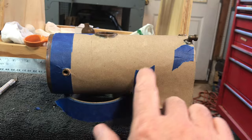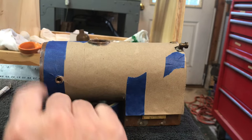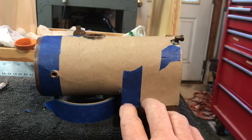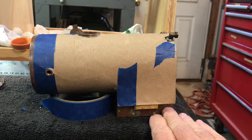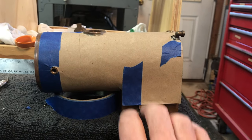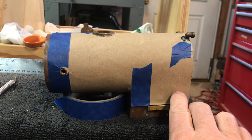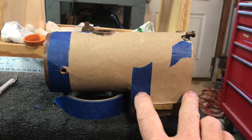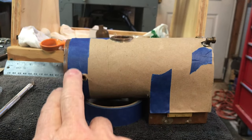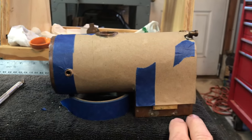I've made this paper template and reinforced it in a couple of areas. I cut it back to accommodate the smoke box, which overlaps at a quarter of an inch. The chassis line is just under here, and those little clips will come up here. I'm hoping I can make this all out of one piece of sheet metal and roll basically everything in a cylinder, except leave these two little one-inch-long portions on either side as flat tails that will stick down and the clips will hold them. I'll probably make at least two brass bands — one around here and one here — to hold it in place.